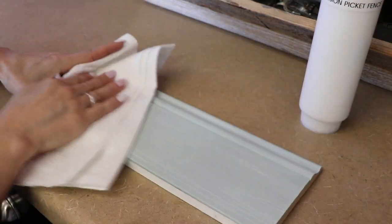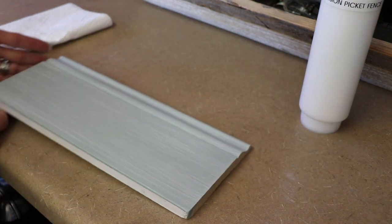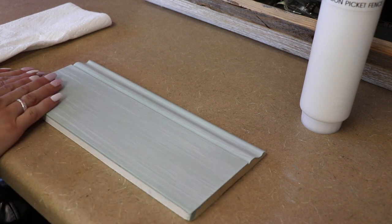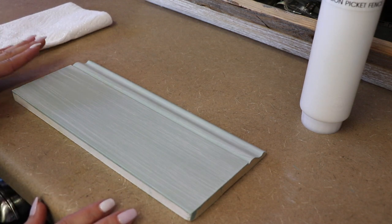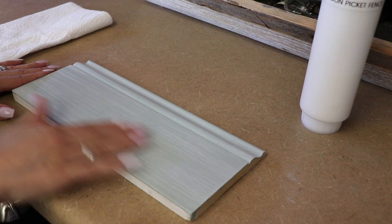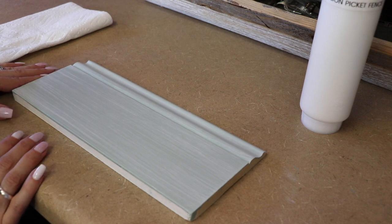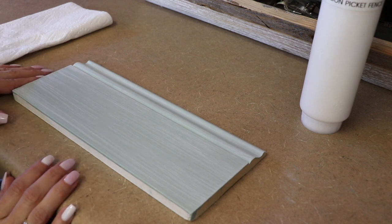I'm going to take the other side of my paper towel, wipe this off, and show you up close. That is super pretty. Now, once you've sanded — we've got our base coat with a top coat built in, we dry-brushed paint and water on there, and we've sanded it — it's kind of got that scuffed, dry look. I prefer to seal this because it will continue to add durability to the paint. It'll also deepen it up a little bit. So I'm going to seal it with Fusion's clear wax to give it a little extra sheen and a top coat.